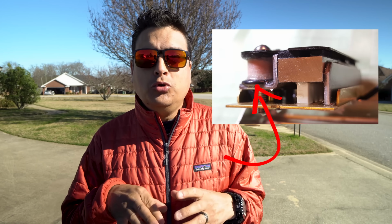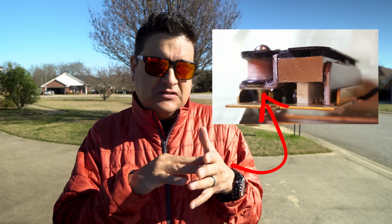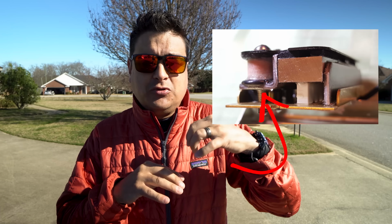It's not a humbucker. It's a single coil with a huge magnet with this little horseshoe of steel that goes over to these single pole pieces that are screws on the one side. So it's a very low output, really very low DC resistance, really big magnet, single coil. So it's not even a Filtertron. It does fit in the same hole, but it's not even a Filtertron.